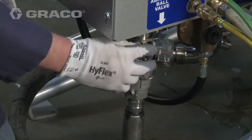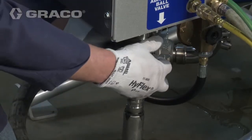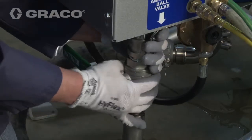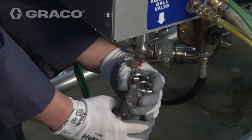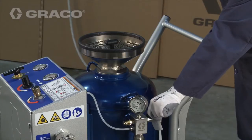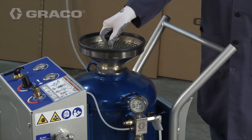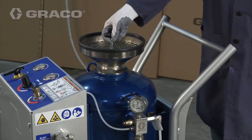Disconnect the abrasive ball valve cam lock by removing the coupler pins and pulling the rings out and up to pull the two cams away from the groove. Open the fill flush valve. Once water is above the pop-up seal, pull up on the pop-up handle to pressurize the pot.